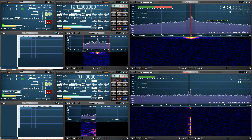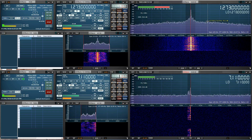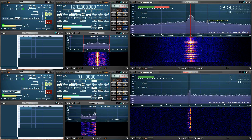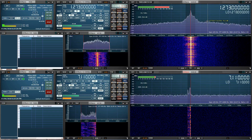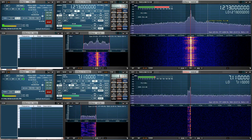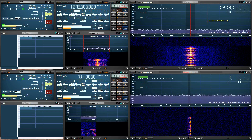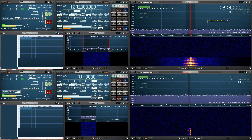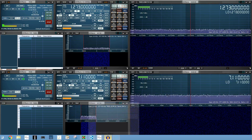This is Jarrod, Victor Kilo 3, Bravo Lima, recording and transmitting on both the 23 centimeter band and the 40 meter band, receiving them both at the same time and decoding them both at the same time using the SDR Play RSP Duo. They're both being recorded as separate audio files and they will be mixed into this video later. So there we have it — that's how simple it can be to avoid the problem of your screen capturing software mixing down your computer audio into mono, and to produce two separate recordings of each receiver.